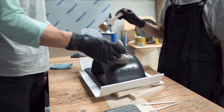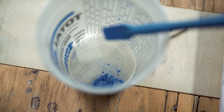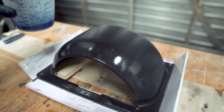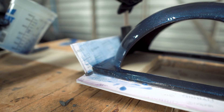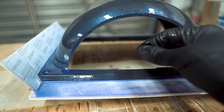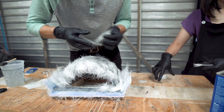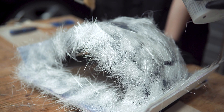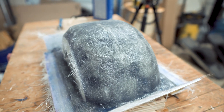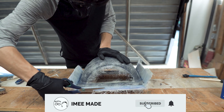We applied a few more thin layers of PVA with time to dry between each layer. Next we mixed 2-to-1 epoxy resin with a splash of blue pigment for contrast and gave the fender a glaze. Dye would have been better than pigment for uniform coverage because the pigment ended up pooling around the low spots. When the epoxy became tacky to the touch we laid shreds of matte fiberglass around the surface, soaking each layer with epoxy. We found that dabbing our paintbrushes worked much better than stroking, and we laid three layers of fiberglass and let it dry overnight.